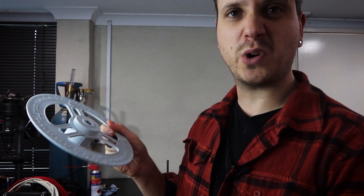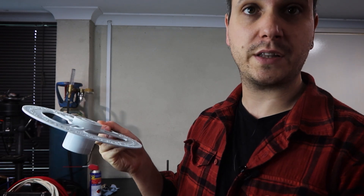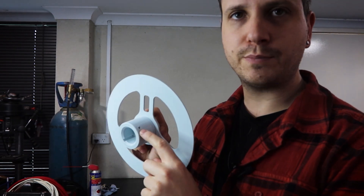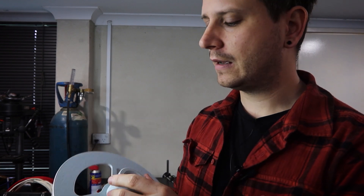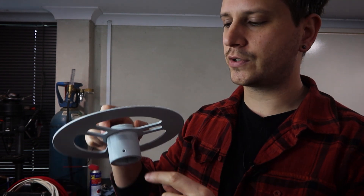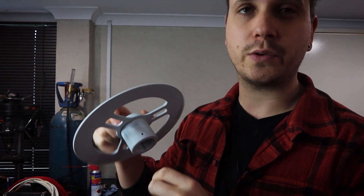This is probably the first time I've designed something in quite a while that I'm quite happy with. I will drill out and tap this smaller thread by hand for the securing bolt onto the crank. The main reason is because of the orientation of the thread and also the size of the thread doesn't really lend itself to the type of 3D printing I'm doing here. It's just so easy to drill and tap it - there's no point messing around.